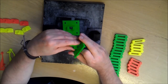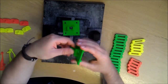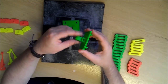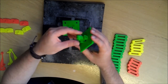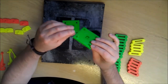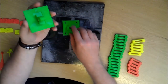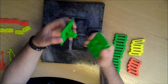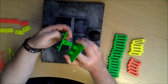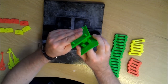All the parts are made out of ABS, so it gives it a bit more give. Now if I printed it out with PLA or a couple of different other materials, it's just too rigid. You give it a little bend, it has no give in it. Hence, all my ball game is made out of ABS. Again, place your finger right slightly behind it, give it a little bend, not loads, just enough to get it over the ridges.